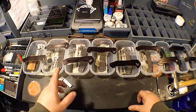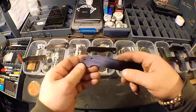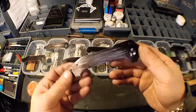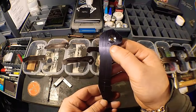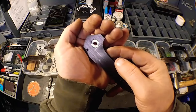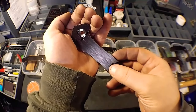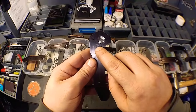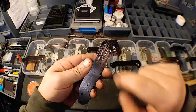All the lock bars are scribed on there. Everything's center punched and ready to rock and roll. And basically they're just blacked out magic marker. And you can see there's my vertical line that I'm going to cut. Here's my face cut going along right here, if this thing will focus. There we go. And then just mark out, it's just a rough mark out for where my relief cut's going to be. And I'm basically just going to come through with an 1/8 inch bit and drill both of these holes out. And then we're going to connect the dots.